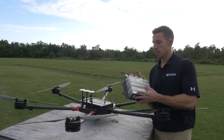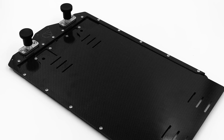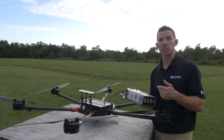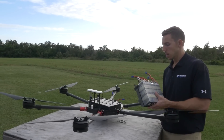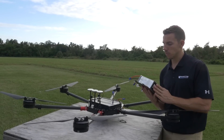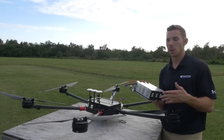Here I have the battery tray. This is a specially designed removable battery tray that's ultra lightweight, really strong, and it's really easy to put the batteries in and out of the aircraft. I designed it this way because on film sets we would always have to hot swap batteries in order to land and get back up in the air as fast as possible — so this solves that problem. Right now I've got four 6s 12,000 milliamp batteries on here, but I'd recommend anywhere from 6s 10,000 all the way up to 6s 16,000, depending on your payload and all-up weight.